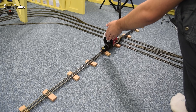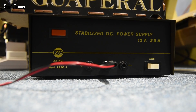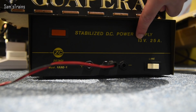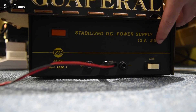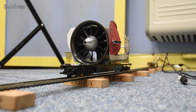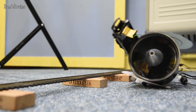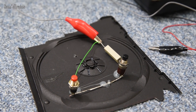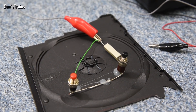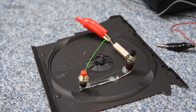The stopping is definitely not the problem - the problem is power. We don't have enough power. The Gaugemaster can only put out one amp; we know that motor can handle two, possibly more. So I need to change controller and power supply. This monster puts out 13 volts - just a tiny bit more than a model railway controller - but it's capable of throwing out 25 amps, that's 25 times what the Gaugemaster could. If I just give it full 25 amps straight away it just throws Salvador over, because the motor armature and blades weigh quite a lot. So I've got this little assembly with a power resistor to allow me to speed up the motor slowly, then when I push the red button I get the full voltage and current.